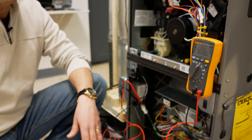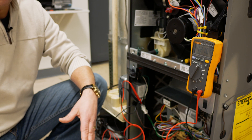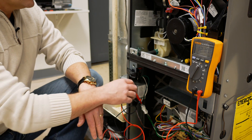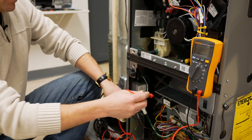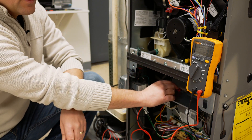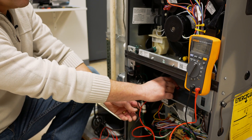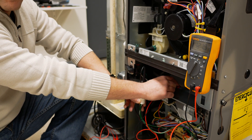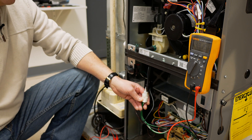We've verified that we have the proper voltage. Next we have to verify that we have the right polarity. Having the right polarity means that the black wire is actually connected to the hot terminal in the circuit panel. We're going to leave our lead on the black wire, remove our neutral lead, and connect it to chassis ground. It should have the exact same voltage — in this case 121 volts — telling us that the black wire is connected to the hot leg of the circuit panel. Most new furnaces will now auto-detect a polarity issue and give you a code stating that you have a polarity problem.